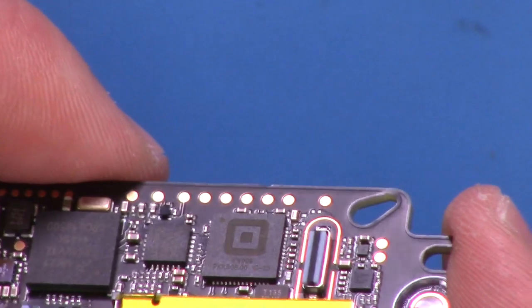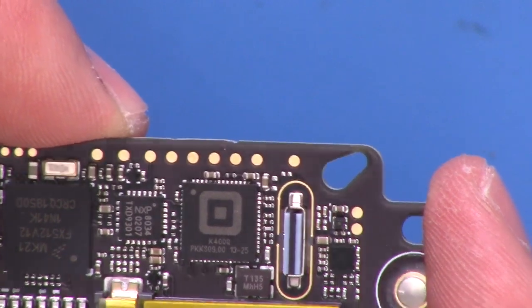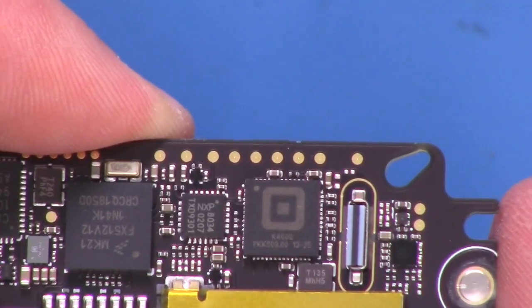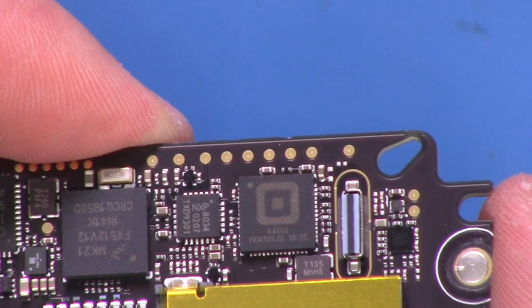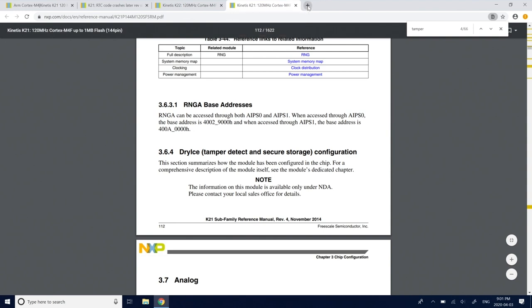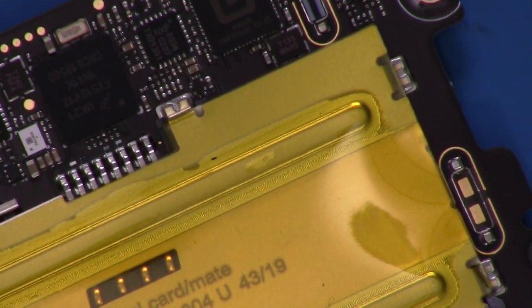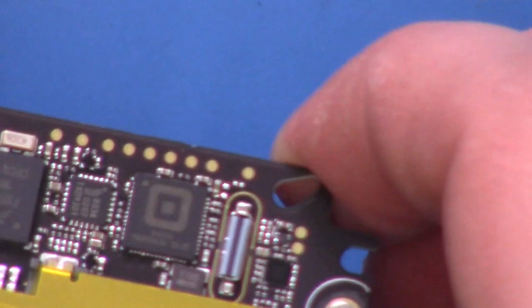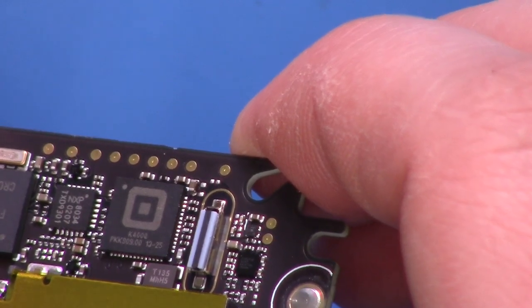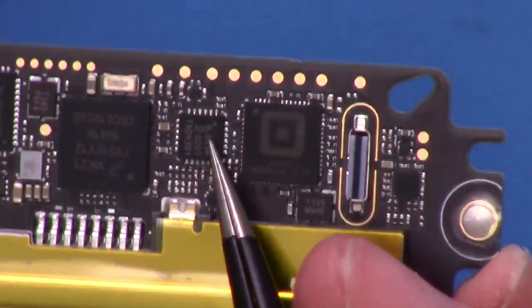There's a square chip - I don't know what this is doing. They've obviously decided to either mark their own device, or this could just be a marked device. NXP device, TXD9301 - nothing comes up. Some of these might be customer-specific marked devices, which is very common if it's any sort of security device. They purposely have part numbers you can't just Google to figure out what they are. So that may also be some sort of security device.